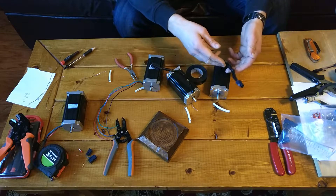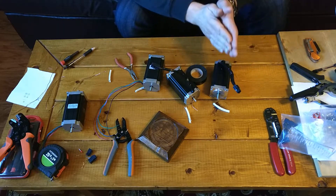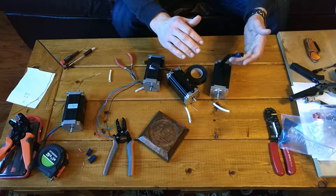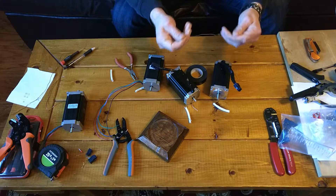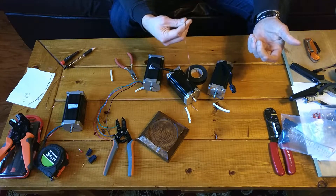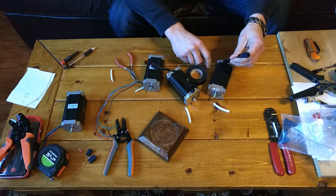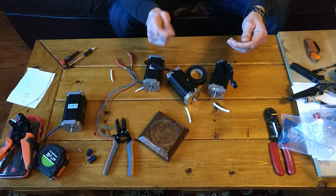Thirdly, if you have to service it and get to the conductors underneath, when you pull all that tape off, the residue stays in the foil — the wires don't get sticky. And that alone is enough of a reason for me to want to wrap the wires before wrapping them in tape. Because when this motor gets hot and the wires get a bit toasty and the glue in the tape begins to melt, it will just become messy and awful. So if I have to get back to it underneath, I can just toss the foil and then the wires will still be clean and easy to work with. Now there may also be some mild shielding benefits of this, but I wouldn't really count on that given that we're not also grounding it. If you wanted to, you could get some copper wire and put that in the bundle and then ground that on the outside — kind of make a redneck shielded cable for yourself. But I don't think there'd be much benefit to that here, because this is only six inches of cable and it won't be running directly along any signal wires. And by grounding this and turning it into that kind of shielded thing, you might accidentally be introducing a ground loop.